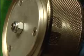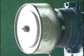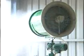No larger than a hand, the atomiser consists of a motor and 2 opposing meshes which cut up the water into monodispersed droplets. The mesh has larger holes than conventional nozzle-based systems. This makes blockages a near impossibility and reduces the risks of harbouring waterborne diseases such as Legionella. When in use, the atomiser spins at a rate of 12,000 revolutions per minute, producing more than 238 billion water droplets.